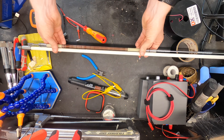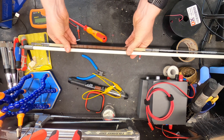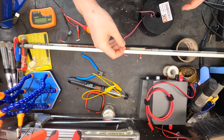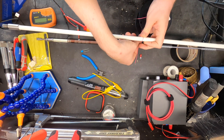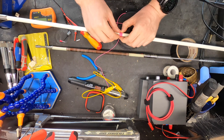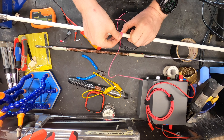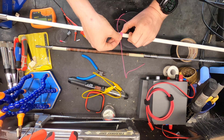This is a pretty similar diameter to the sand flag, and the sand flag is a pretty similar length. So what we were thinking of doing was replicating this coil on the sand flag with this wire. We're just going to deliberately wind too many turns on, then check with the nanoVNA as we take some off and see where we get.